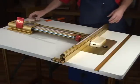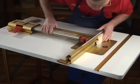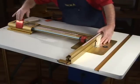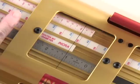We'll begin with the tail cuts. After centering and installing the template, set the fence to a scoring pass position, then clamp the carriage and slide your scale to read zero under the hairline cursor.